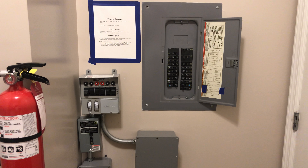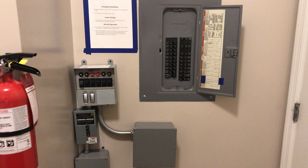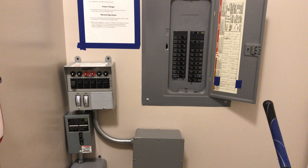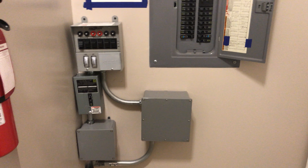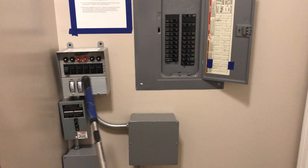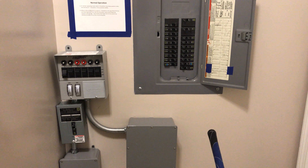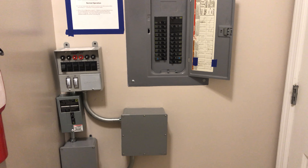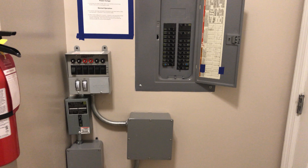Welcome back for video 3 of 3. I wanted to explain my setup here at the power panel side. Essentially, power feeds my inverter, which has its own automatic transfer switch that switches between batteries and utility. That output is then fed into this setup, which interrupts six specific breakers I've chosen — things I basically need to run: lights, TVs, garage door openers — critical circuits I'd need in a power outage.